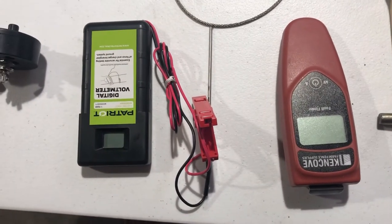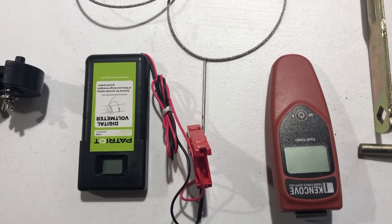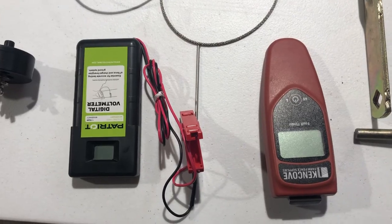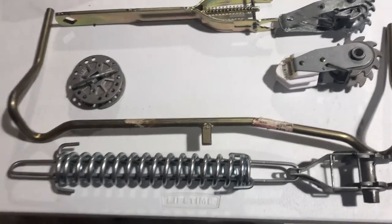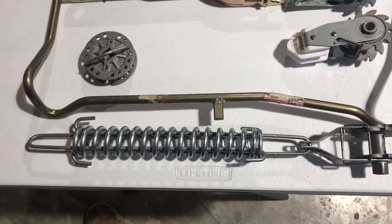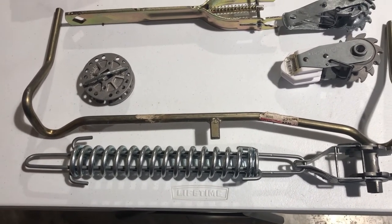We also have volt meters. You've got to have a volt meter — you've got to know how many volts are going through that fence. I really like the one here on the right. A lot of chargers nowadays even have an on-off switch so you can shut the charger off anywhere on the fence. We also have three or four different ways to tighten fence and the tools you use to tighten them. That spring piece — if you had an area in the timber and were worried about limbs falling on the fence and you didn't want to break it, that might be a place to use that equipment.